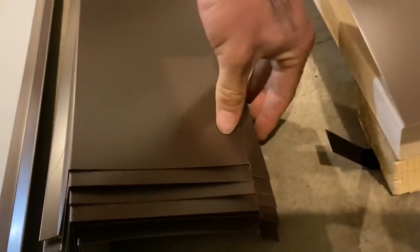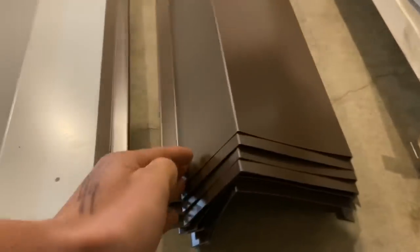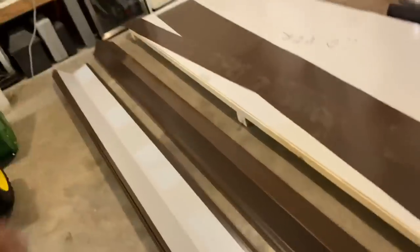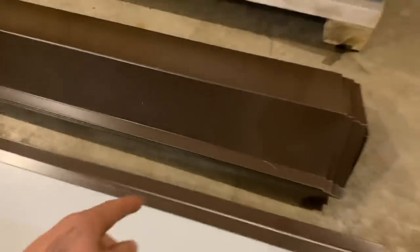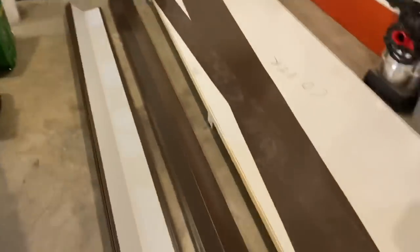And then this is the gable flash. I put the extra bends in it, obviously, so it can get up over the rib and then down. And then how I'll get this around the radius to contour it is probably put slits in it every foot or so, maybe 6 inches I'll have to. And then it'll just kind of fold over, and then I'll have a corresponding slit right there so it can just kind of bend and follow it. That's really the only way to do it.